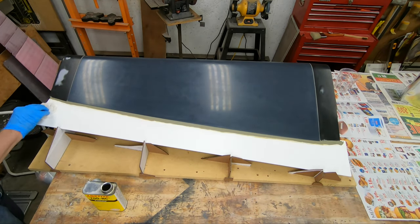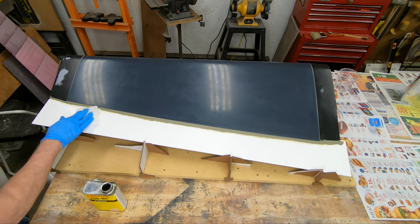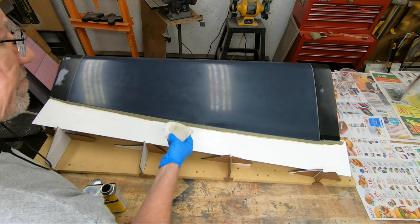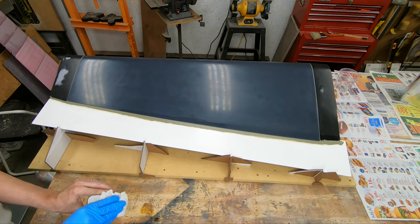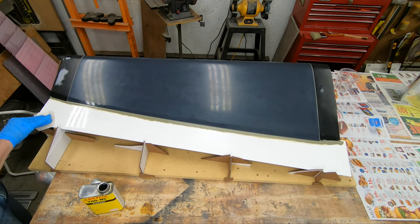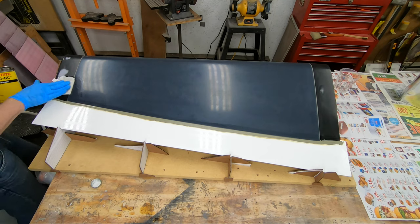I did not know if the white flange material would stick to the epoxy — I hadn't done a test — so I decided to put some release coat on that white flange material. I also didn't know how well the plasticine would stick to epoxy; I don't think it sticks at all, but at the time I wasn't sure, so I wiped the plasticine with some sealer as well. I reminded myself not to reuse this plasticine since it had sealer on it — I wanted to throw it away at the end rather than put it back in my plasticine box.